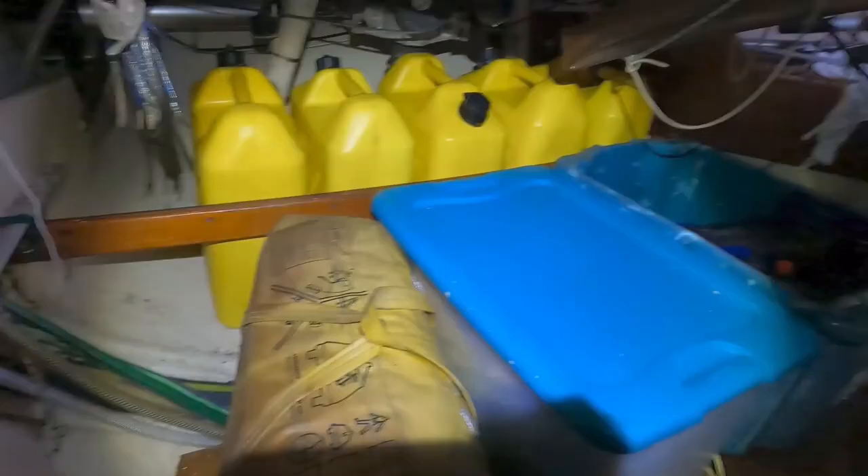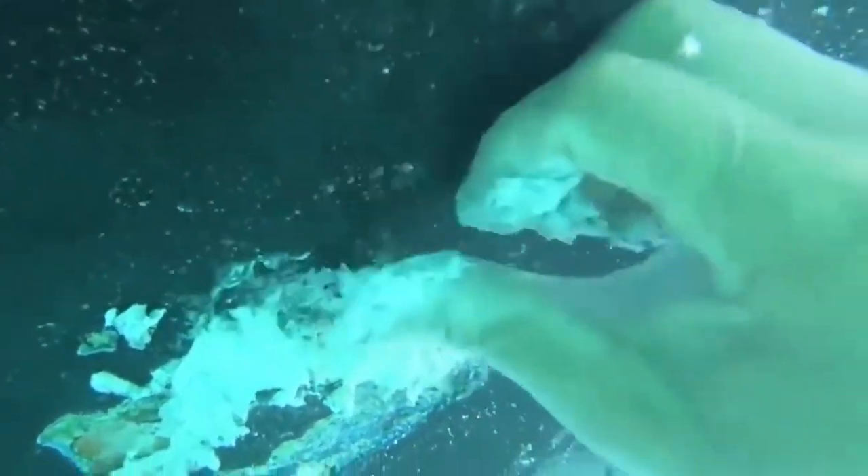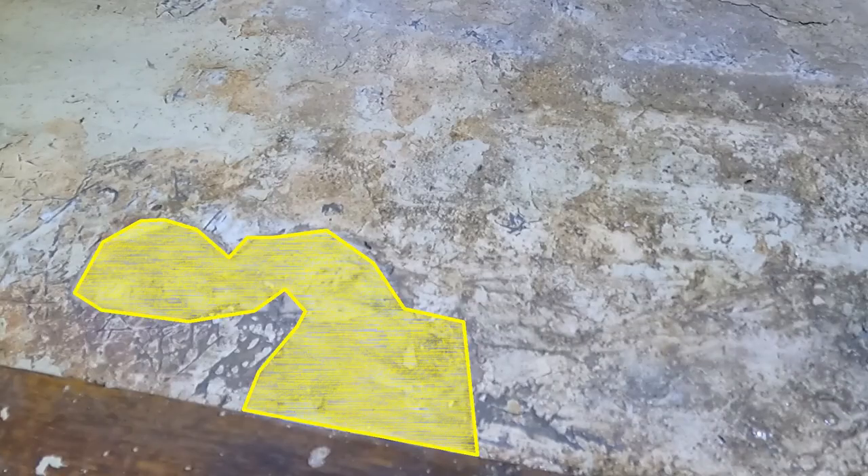What I'm also going to show you today is the leaking or the weeping is getting worse. Now, when I first discovered this it was a bit of a shock. Normally this area under the helm looks like this, so basically any weeping or leaking here just quietly went into the bilge under the motor and automatically got ejected by the bilge pump. This is the area that I found wet with salt water — it appeared to be leaking from three holes. I removed some paint, dug the holes out a bit, and keyed in some epoxy filler to seal off the leak. The area is dry now, so this repair is doing the job, but I'm curious to see how it is underneath.